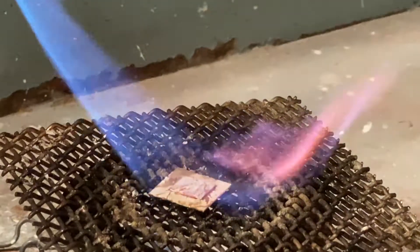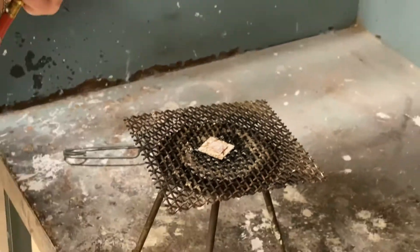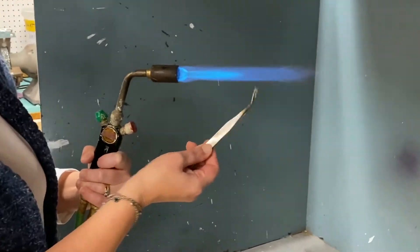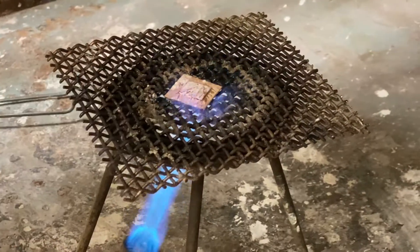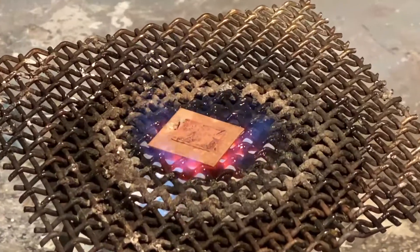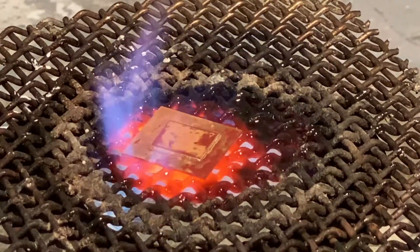Once I have everything bubbled up, I'm going to change my flame to that really large pointy flame — it's about three or four inches large, and the tip is the hottest part. I'm going to take that and go underneath my piece, with the tip of the flame right on top of my larger piece of metal. What you'll notice as I'm soldering is that you'll see along the seam — right in here — you'll actually see the solder completely once it melts. Once you see the metal start dancing like that, the solder will melt pretty quickly thereafter.